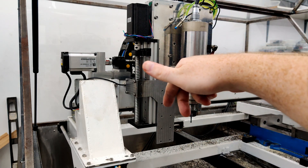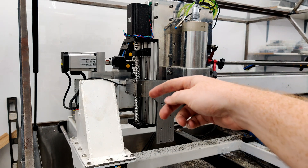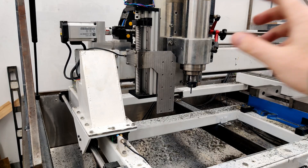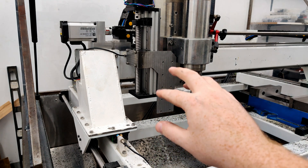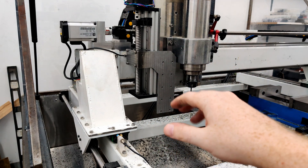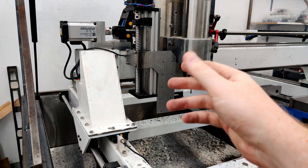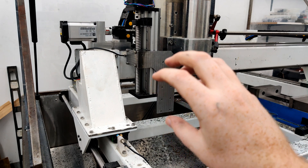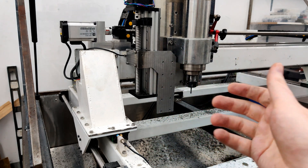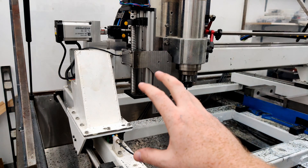I could put it on the back of this piece of steel, or have a proximity sensor horizontal facing this way and intersecting with the plate — that might be a cleaner approach. The next thing is to machine a few small aluminum pieces. I know I'm going to use positions one, two, and three, and then I'll add some rails and bronze bushings with a spring-loaded sliding piece that the webcam sensor attaches to. I might even 3D print the whole thing to test the shapes first, then machine it out of aluminum.